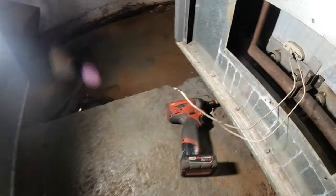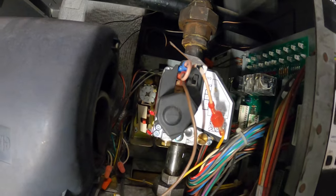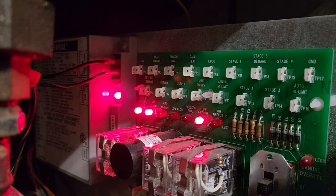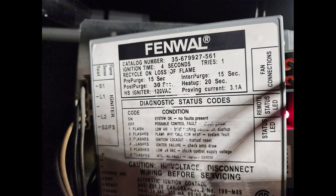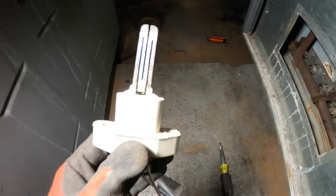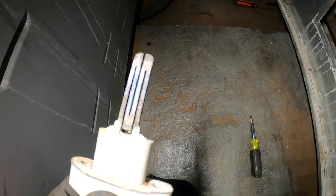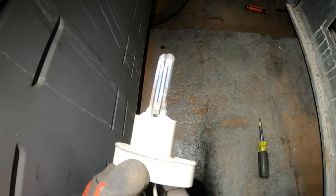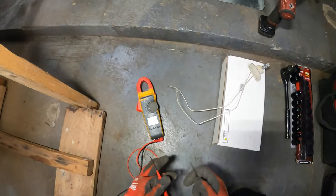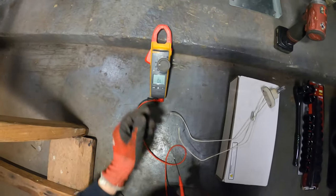I noticed before we shut this one down — the reason I shut this one down is it works in conjunction with this one. We had an igniter failure according to our ignition control. We had four red flashes. Inside that hole is where the hot surface igniter sits. There's some terrible discoloration on this thing — it's probably pulling amps but not enough for proper ignition. Whenever I get four flashes on that ignition control, something is up. These things seem to go bad all the time — very common on these.